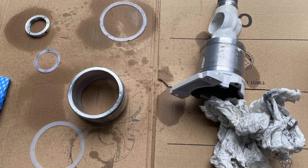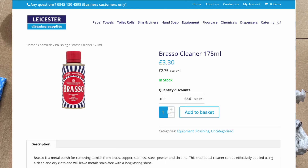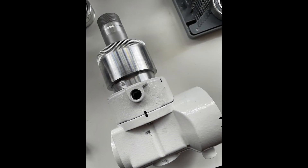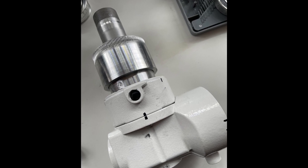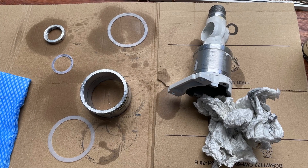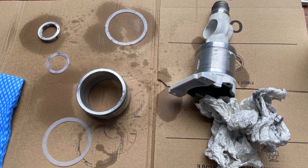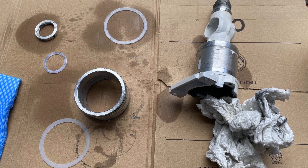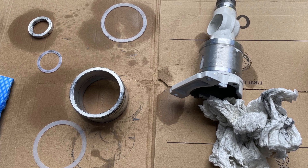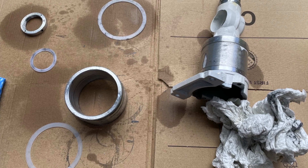Once that's done, I also used a bit of metal polish — I think it's called Brasso — to polish up any of the surfaces and remove any nicks so that they're all nice and smooth. You can also use some really fine-grain wet-and-dry paper to smooth out those surfaces as well, but you need to be really, really careful. These pieces are all fundamentally machined to precision, and if you start taking away too much of the layer itself, they're not going to fit as smoothly, and your guiding will be worse than it was to start with. So please take care with that.